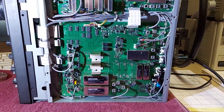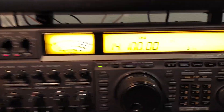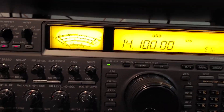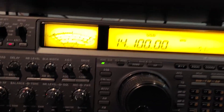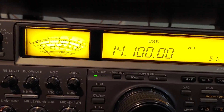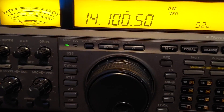Now I'm just going to double-check it with my other transceiver to make sure it's on frequency. Here we are on 20 meters — when I go into transmit on FM there's no beat tone at all, whereas before there was a significant beat tone. Now let's go to AM and check the same thing — and there's no beat tone there either, and there was before. So that worked. It's really interesting why there would be a frequency adjustment just for those modes.